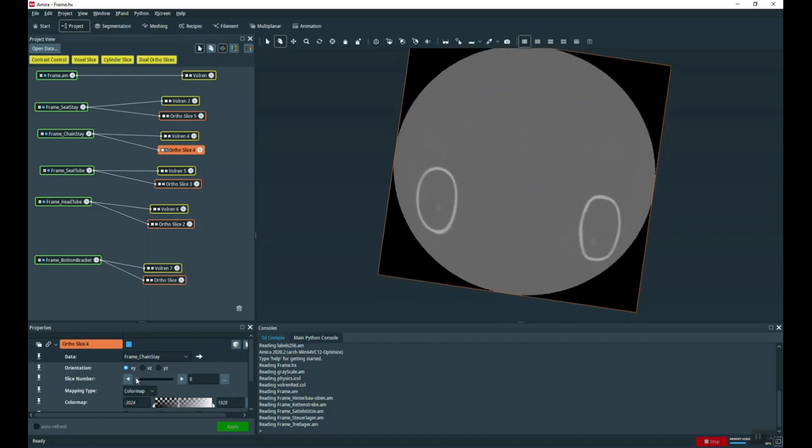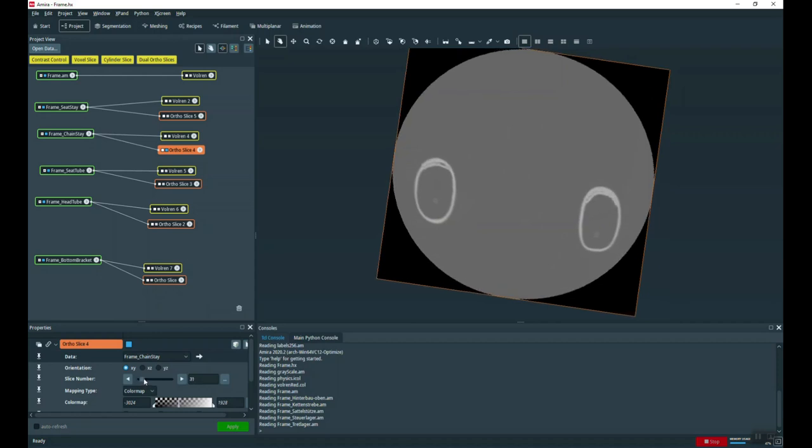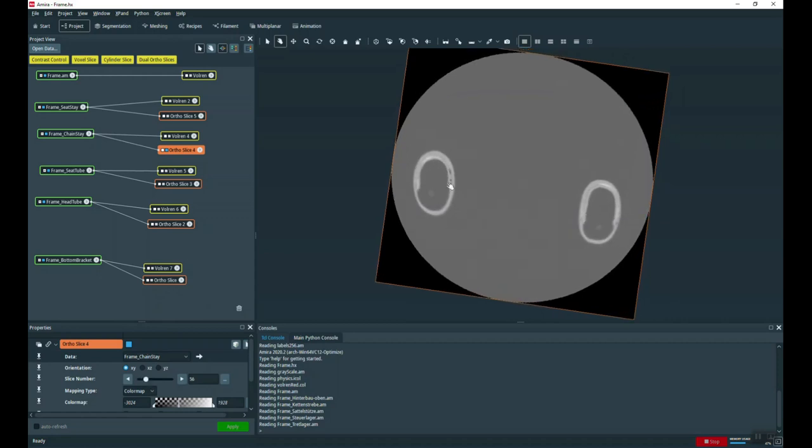So what you can see here, the two dots in the middle of the tubes, these are actually the plastic guides for the internal cable routing, which are already placed inside, so you don't have to worry about these. We just look at the outside boundary, and when we scroll through the images, we also see here some trapped air within the carbon layup, visible from slide to slide.